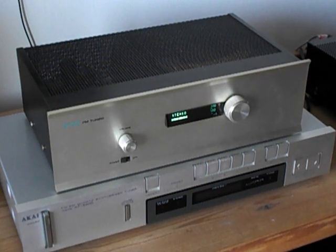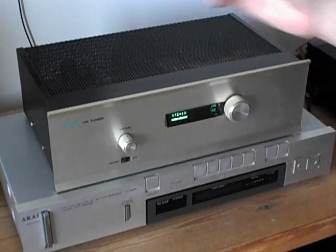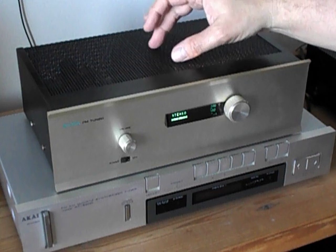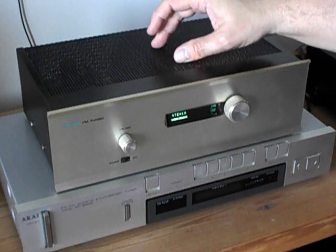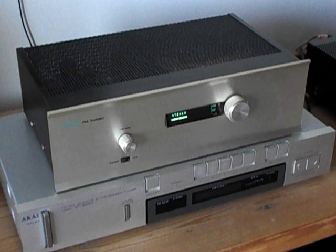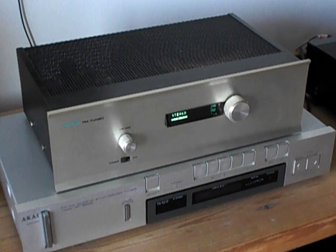Now the tough thing, there's a metal capacitor can, 40, 40, 20, 20 microfarad, 350 volt. I bought some of these reproduced cans, and I've had quite a few of them fail early. It's hard to stuff caps into a can. I know they shouldn't fail, but some of them have failed within weeks or months.